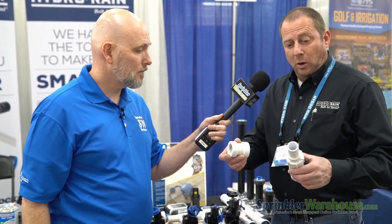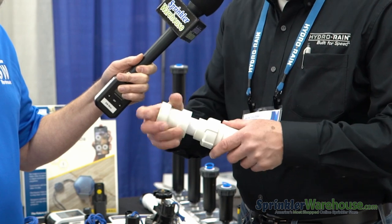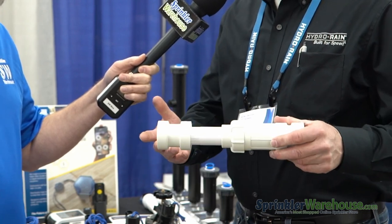It's a little bit earth friendly too, isn't it? It's very earth friendly — no glue, no clamps. That's what makes it fast. The way it works is similar to the SharkBite operation. Like here's a slip fix one inch — literally push that on, connect it to the pipe and you're good to go. You don't have to wait for glue to dry. You can turn the water back on and it's good to go.